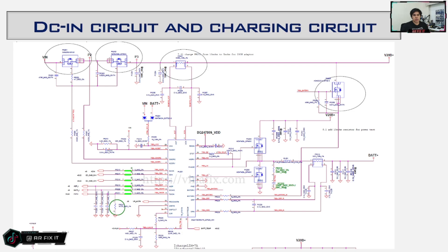The charging circuit of a laptop motherboard has two designs: it's either HPB — Hybrid Power Boost — or NVDC, the Narrow VDC architectural design. In this example we are going to discuss the standard HPB design.